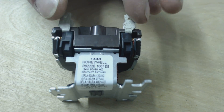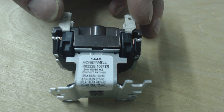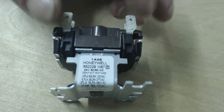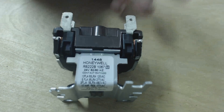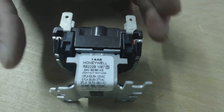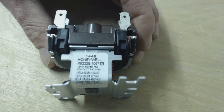So if you tested here, you should have resistance when you have this all unplugged — take all the electrical wiring out and make sure it's not powered. Then take your resistance reading here and you should get maybe somewhere between 10 and 20 ohms of resistance on a 24 volt general purpose multi-purpose relay.